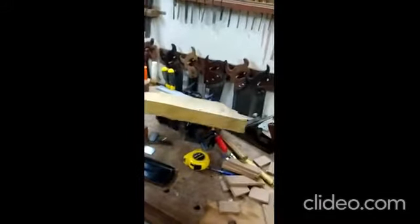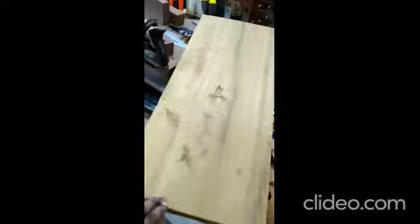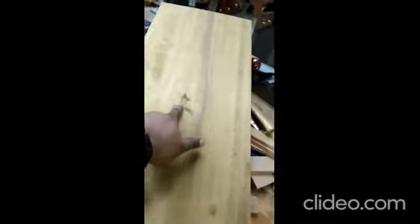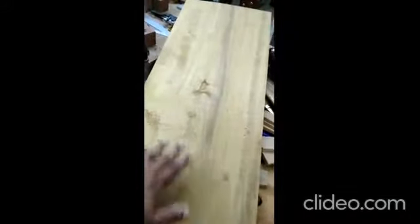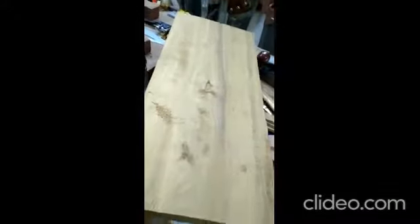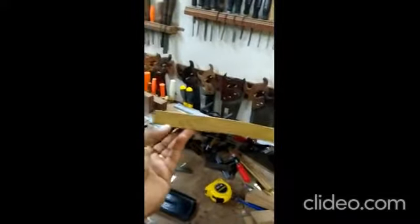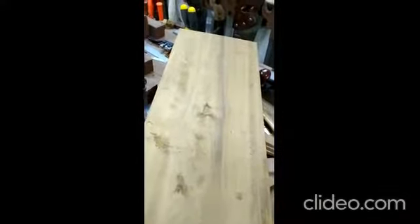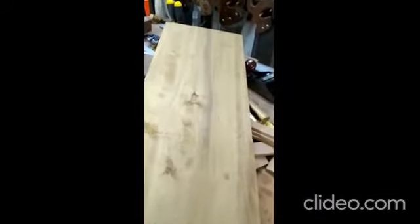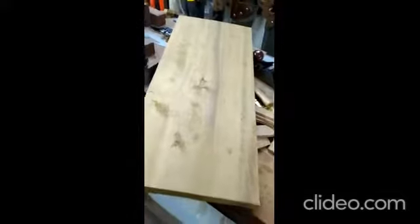There is this cup in the board. In order to prepare this stock for use in the cabinet, I need to mill it to remove all these defects — I need to plane it. Some of the stock will be removed. In order to straighten it, much of the stock will be removed, which will actually reduce the thickness below the desired level. I am looking for a thickness of 11/16, which I cannot achieve by just following a straight milling method.